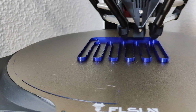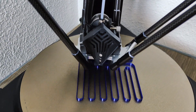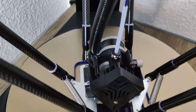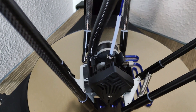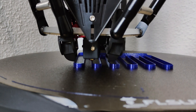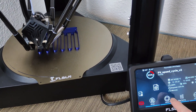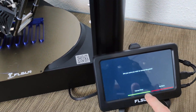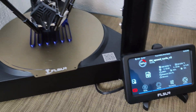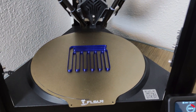Then I decided to use a speed test to increase the speed and temperature and see how it was responding to the changes. Finally, at a speed of 96mm per second and 268 degrees Celsius, I was satisfied. At the moment, I am content with the fact that I am achieving 4 times faster printing speeds with my PET filament compared to other printers I've previously used.